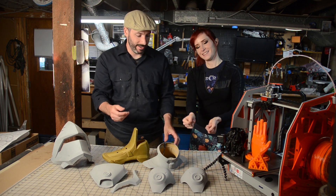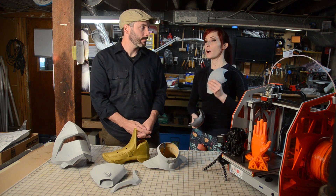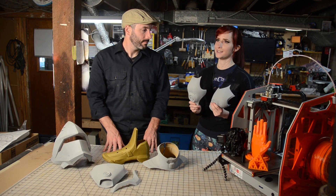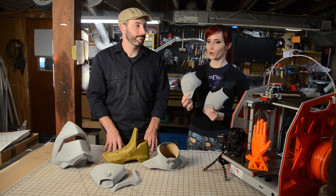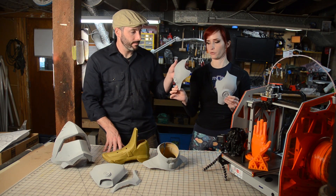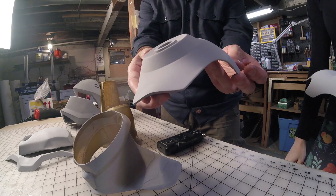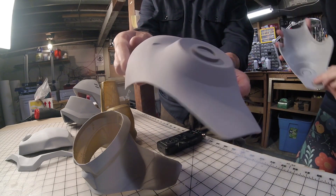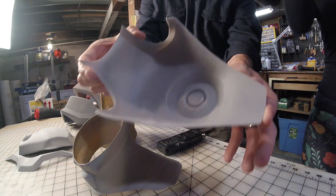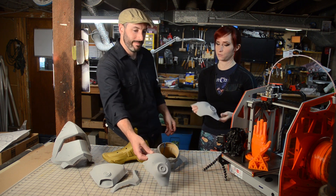The one I'm probably most excited about are these pieces right here. I've been playing around with one of my newest printers, the Formlabs Form 2, for a while, and I haven't really utilized it for cosplay stuff — I've done action figures, tiny movie prop replicas. But I realized if I can print something on the Form and have it turn out perfectly, I can cast it and save myself lots of finishing time. These are D.Va's shoulders from Overwatch. They were printed on the Form and just sprayed with filler primer — they haven't been sanded yet. And they are absolutely perfect. On the backside you can see little dots where the support material was holding onto the piece. They were essentially lifted out of a vat of resin with support material on top, and they turned out pretty much perfect with very little finishing work needed.